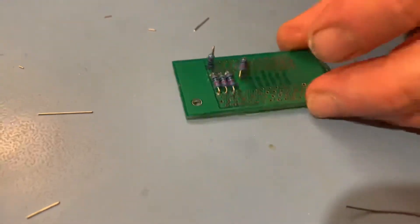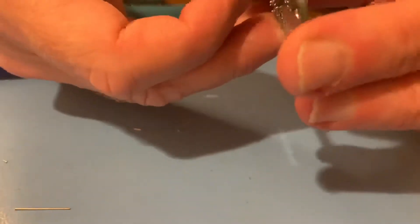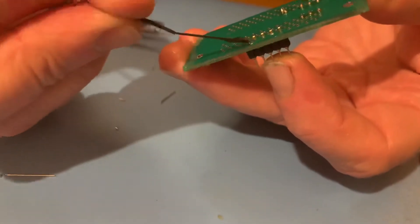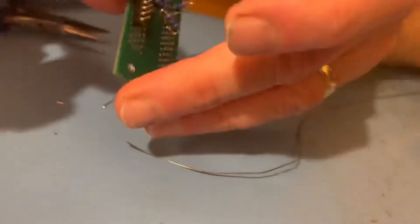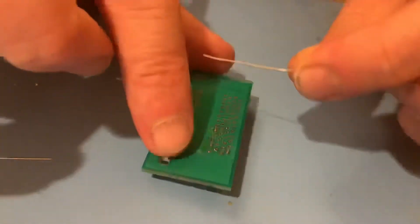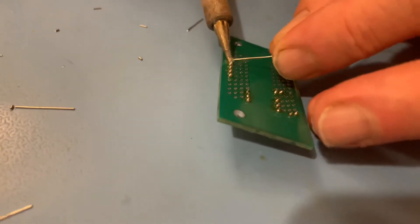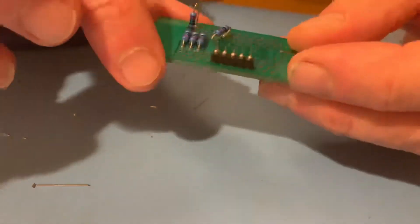So you've got your three methods: the conventional method, the upright method, and the flat-down method. Now this is a typical connector for a through-hole board. When the pins are a little bit long I always like to crop my legs — you risk shorts if you don't. Always crop your legs before you solder otherwise you could fracture the joint. Add a little bit of flux along, tin the iron, and just tap one end. Look along it to make sure it's nice and straight and flat to the board. Once you're happy, tack and check, then solder all five joints — two or three seconds each for a nice secure joint going through the barrel.